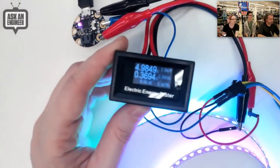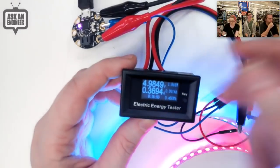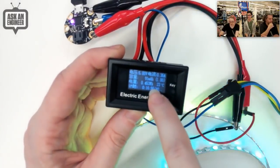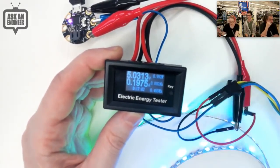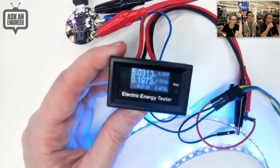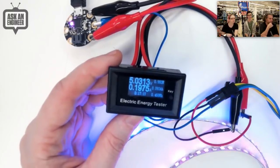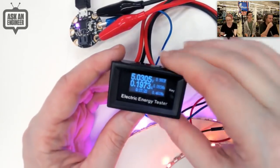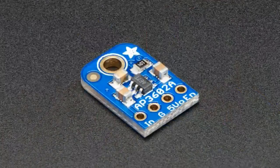You can see it'll give you the voltage and current, and it'll keep time — I've had this on for 16 minutes — and then tell you amp hours and watt hours. It's pretty sweet with quite a bit of built-in capability. It also gives you the temperature in degrees Celsius. It's an all-in-one screen with a couple of extra modes, like over-current, under-current, or over-voltage alarms. Very nice power monitor for your project.